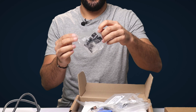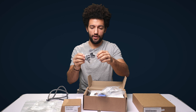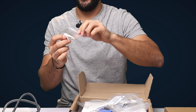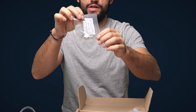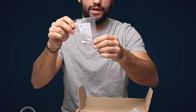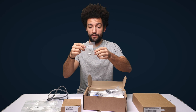We've got a plug housing — the smaller one — and this is for the nine-pin connector which goes into the back of the TC20 control head, along with the TC20 plug itself and some pins. There's also a TNC connector, which you can use to connect the transponder to your coaxial cable in the aircraft for the transponder antenna.